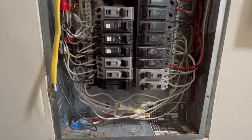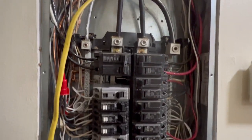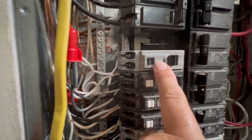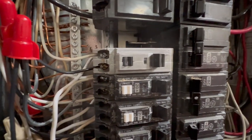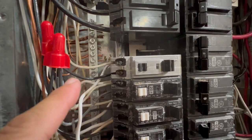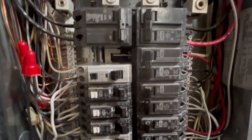To my fellow electricians — I know this panel is a mess and I should be ashamed of myself. But I just purchased a piece of equipment that keeps tripping the lights and the fridge, and I'm sure my wife wants it fixed like now. So we have the new breaker in here. I don't have any wires to it yet. Here's my wire. Because it's an arc fault it does have a little pigtail going over to the neutral bar. We're going to strip this wire, put it into the breaker, and then go up in the attic and change this over. The new breaker is in. Notice there's a white silver lug for your neutral, a gold lug that is your hot, and a neutral coming off the breaker itself that wasn't long enough to reach the neutral bar — we had to add a little bit to it. Because this is not the first means of disconnect, the grounds and neutrals are separated.